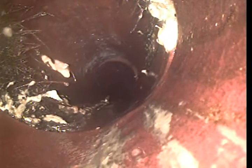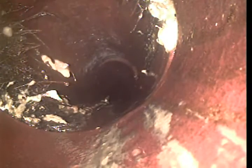I'm continuing to pull back here. It looks like a root growing down the side of the pipe. At first I thought it was a snake — it's actually a root growing down the pipe. A bit of a root intrusion here. That's another thing about the joints: the joints seem to be the best spot for roots to grow.